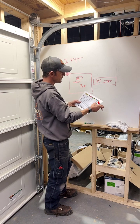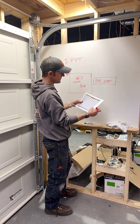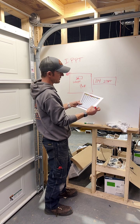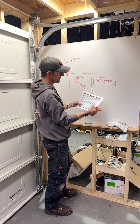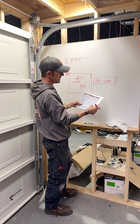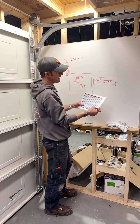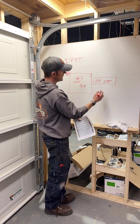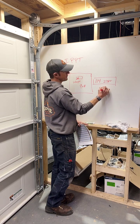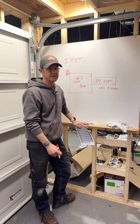If I'm using two inch ID — which that spring chart is in my hands — then I'm going to use potentially a pair of 273 at 56 and a half. And that's going to give me really dang close. If we're within three IPPT, that generally plays to balance it out.